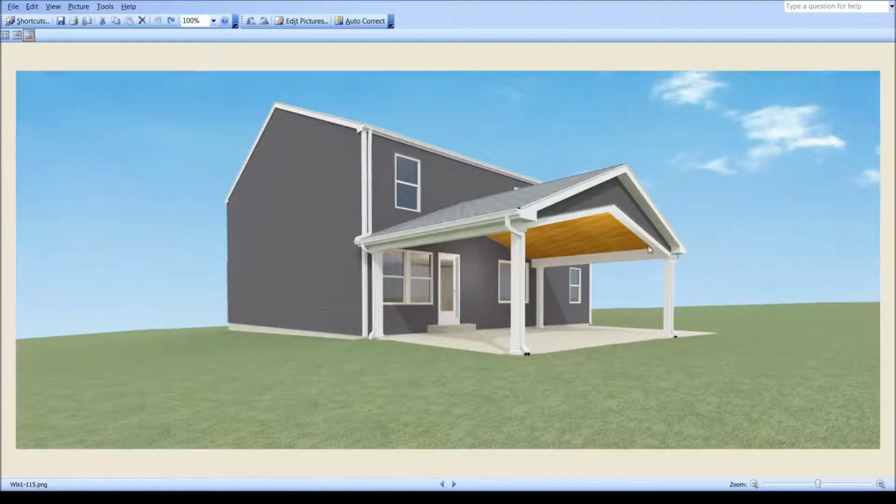They come down where the bottom of these false beams are coming down with the bottom of these on top of this column. And out here I have about 6 inches, and then the siding arrangement is mounted over that, laying over that. Alternately to that is something like a king post type thing put down through the center, and then the siding is recessed and essentially sits about flush with these beams here. And this is a 7¼ inch post with a beveled bottom.